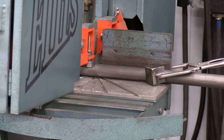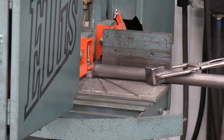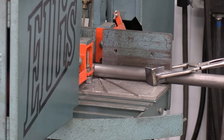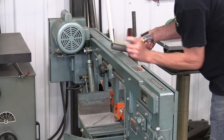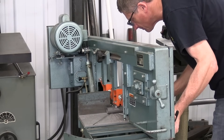These don't have to be heavy wall tubing. I use inch and a quarter .065 wall DOM or 4130 chromoly tubing for the crossbar and one inch .065 for the diagonal bars. I'm also cutting two inch and a quarter pieces that will be used for my bolt mounts.